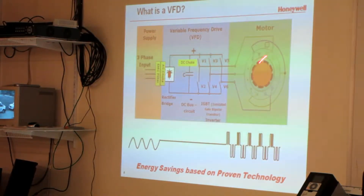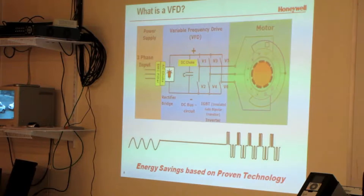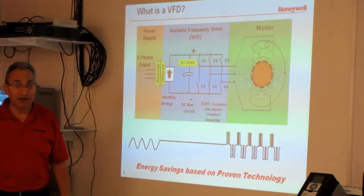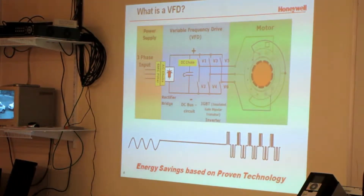The inverter drives the motor through these outputs. This is a very simplified diagram. The AC coming in is converted to DC, which means that if the motor is running backwards, you don't reverse the input wires here — it won't make any difference to the output. You have to reverse the output wires. How many of you have run into that? You change the wires coming in and it doesn't make any difference — because you're changing it to DC first.